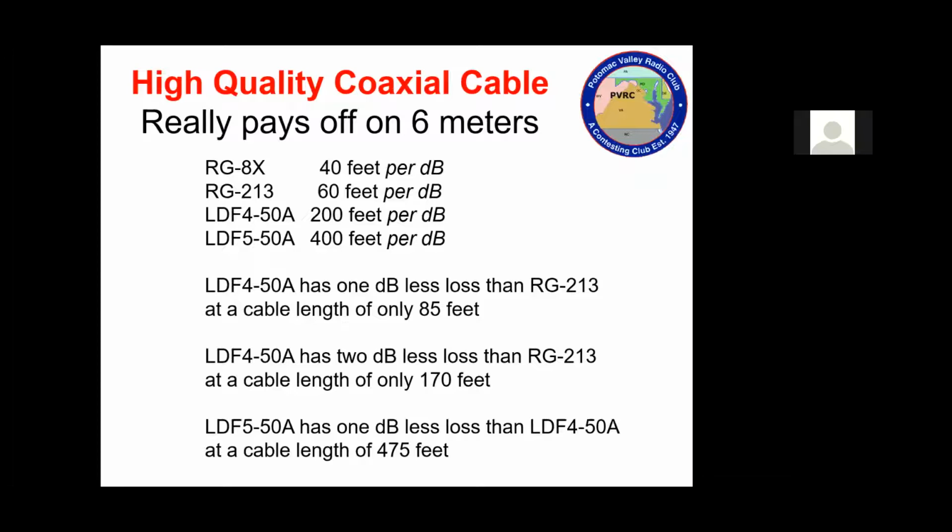And the other way that flexible jacket coax cables get damaged easily on towers is if they're not taped frequently to the tower face or to the tower leg. At least the cable should be taped to the tower at least every 2 or 3 feet, no more. And why is that? Because it will vibrate in the wind and the jacket will get damaged.